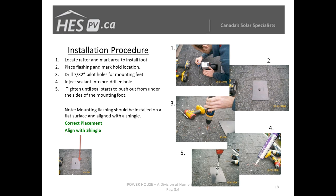Once you've found all the studs, you can place the flashings where your feet are going to go. What we usually recommend is taking each little flashing, tucking it under the shingle where you're going to put a foot, and placing them all on the roof. That lets you step back and look at where all the feet are going to go, make sure you have it done right, and verify you've ordered the right amount of parts — if you're five short you'll catch that now before drilling anything.